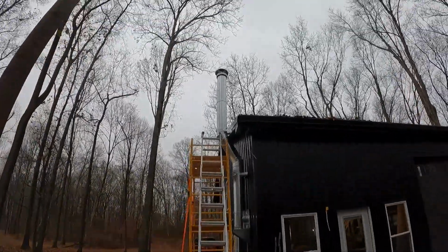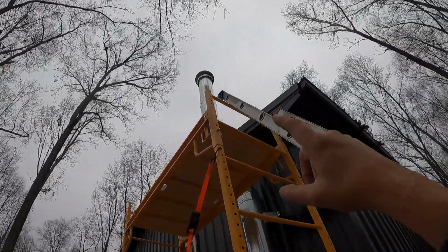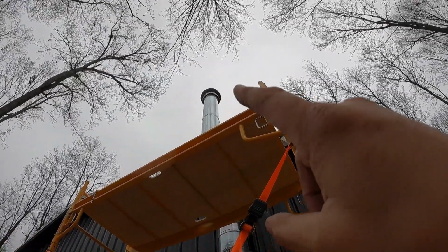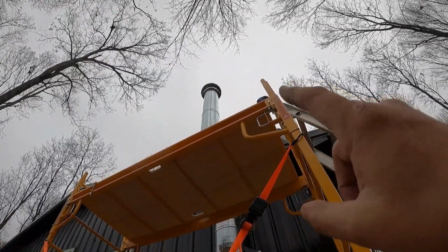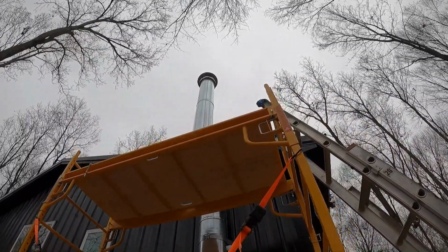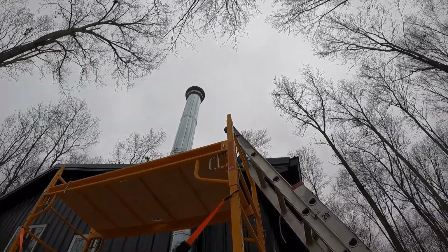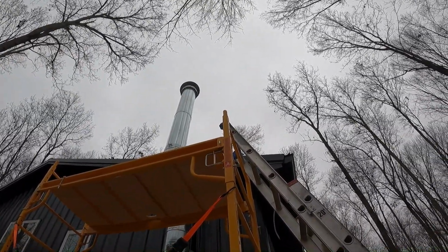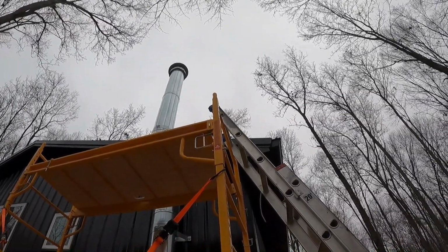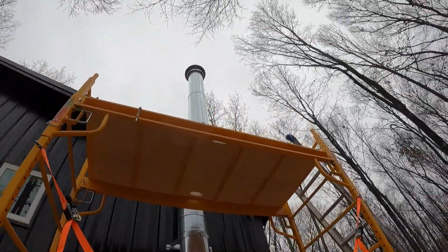So when I put those 4 screws in, I actually put 2 in originally, and I saw this issue and I put 2 more thinking I could correct it. But if you look up at it, you see where it kind of bows out. It's a little too tight. What's going on is those screws are a little bit short, and for me to get a good bite with a couple of threads, I had to go a little deeper than I need to. So I'll get some longer screws, take those out, replace them with the longer ones, bend it out so that it's not curved in there.